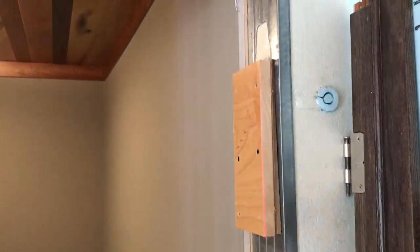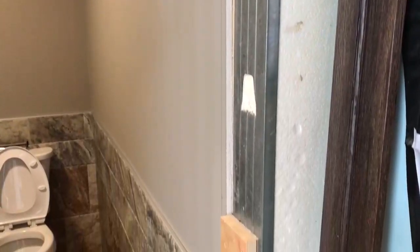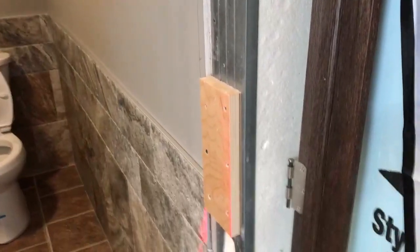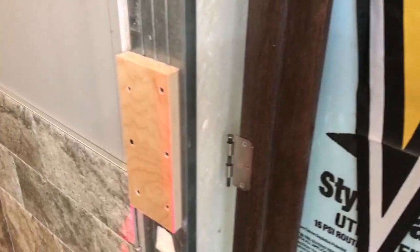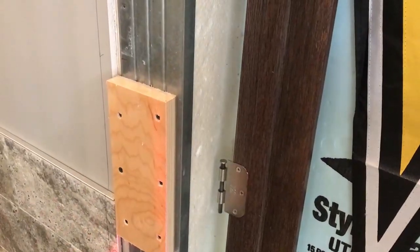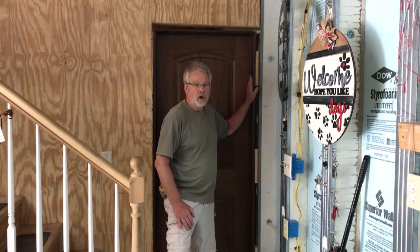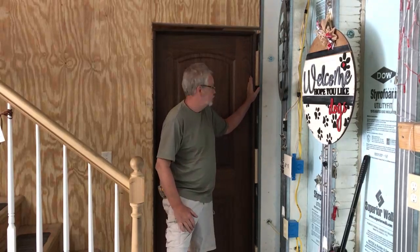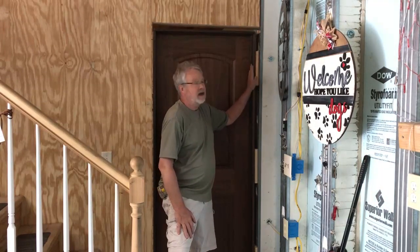And we started out at the bottom with 3/4. Our middle is about 15/16, and the top is about 1/8 of an inch. We've secured these with like 6 drywall screws, and what I'll be doing is taking the screws out of the hinges and going right into the blockings. We have our door jamb secured to the wall with 2.5 inch drywall screws in the hinge area, so they're not noticeable, but we've really got that secured well.